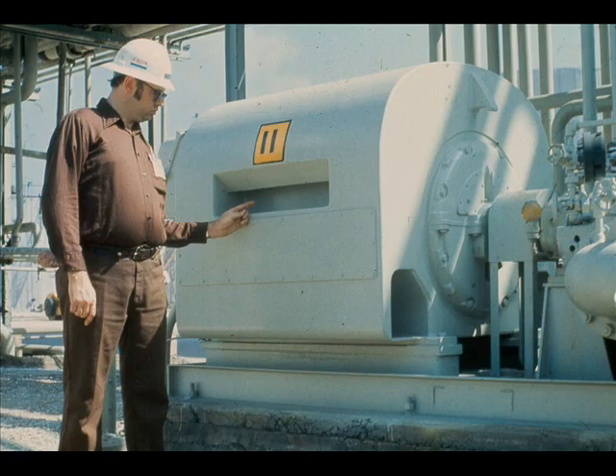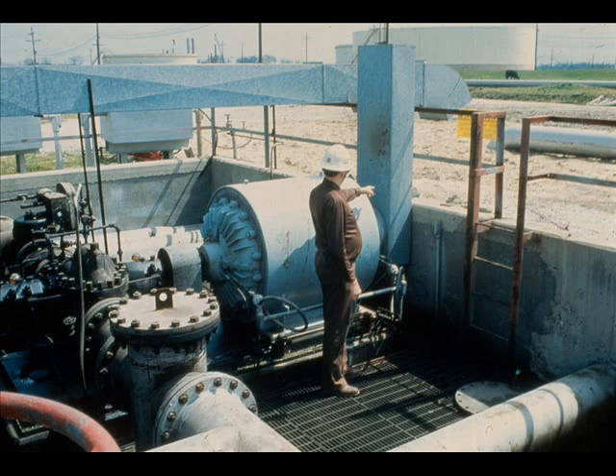The enclosure will block water coming at it from any angle ranging from straight down to 10 degrees below horizontal. This motor is weather protected. It has side openings through which air travels up into the space above the stator. Rotor fans draw the air from this chamber through the motor windings. The heated air is then discharged through the outlet vents. This is what is called a pipe ventilated model. It is totally enclosed except for inlet and outlet air openings. Ducts are connected to the inlet to supply clean dry air, which is circulated through the motor and discharged through the vents.